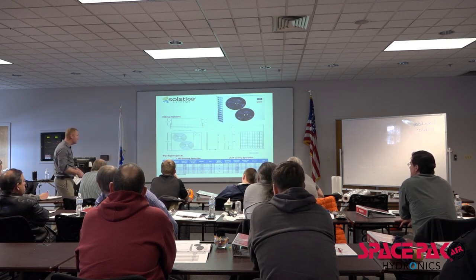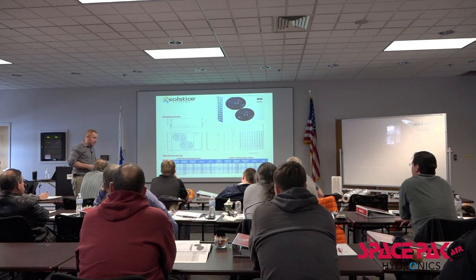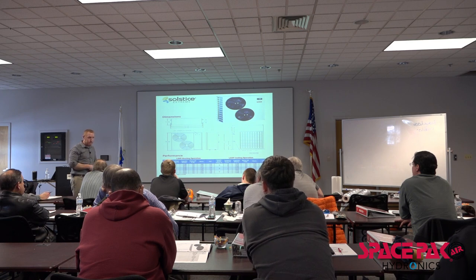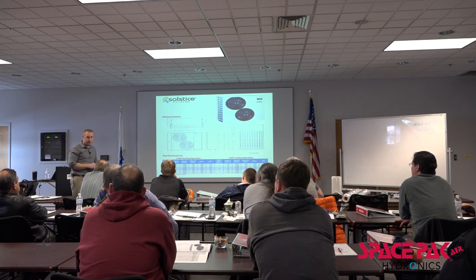Okay, that's at 130. And the kicker, right, we look at our COPs over here, and we're 2.3, 2.7, we're over 3 COP, okay? My heat pump at the house, I have an LAHP, I have a 30-gallon buffer tank inside, and I have an air handler. And everything in my house is electric, and I live in New York State, and I'm just about through the winter here, about $260 electric bill.